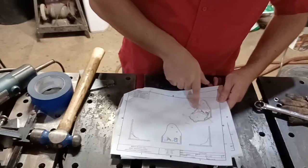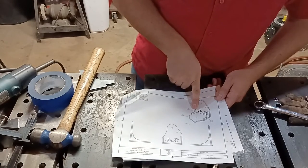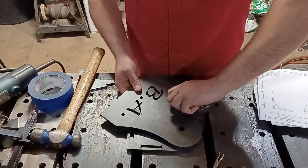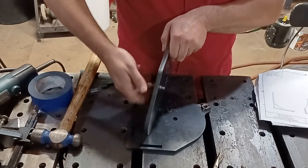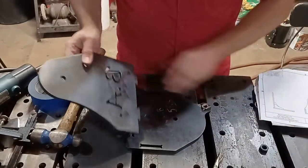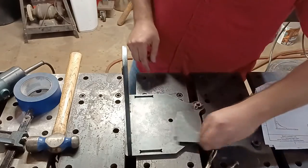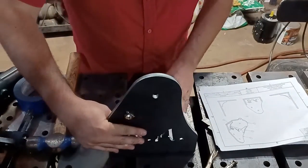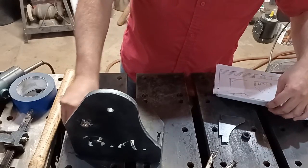The next welded assembly we're going to build has two different sized gussets. The key is making sure you put them in the right spot — otherwise your motor will hit this part if you put them in the wrong spot. I'm going to take out the spring pins because I don't need them for welding and I don't want weld spatter on them. The easiest thing to do is set your picture down and then set your frame just like the picture — honestly the easiest way to make sure you don't make any mistakes.